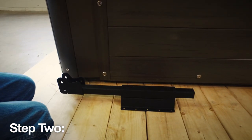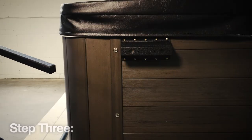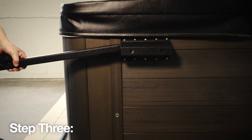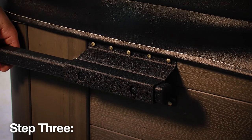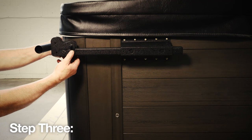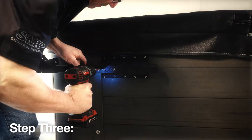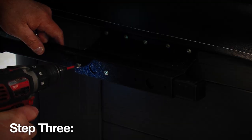Option 3 is a deck mount. You can rotate your bracket for a deck mount, a deck-and-side-tub mount, or a gazebo mount. Step 3: Insert the sliding pivot bracket into the mounting bracket as shown and position it so the back of the bracket lines up with the back edge of the spa. Then secure both slider pivot brackets using the number 10, 5/8 inch self-tapping screws.